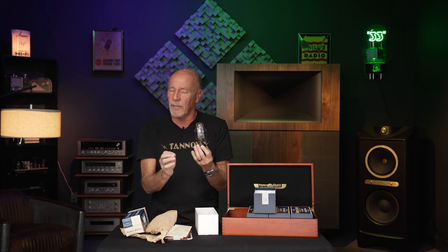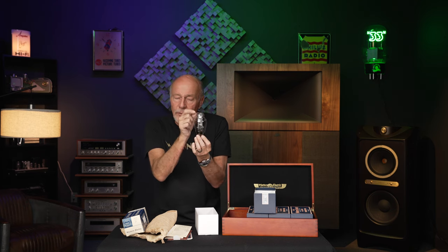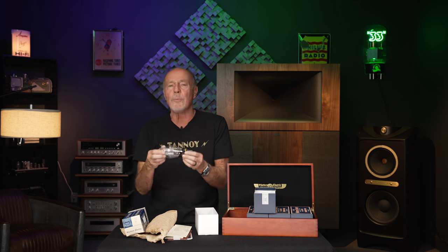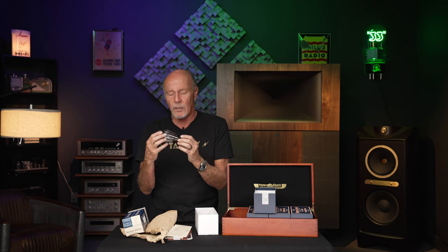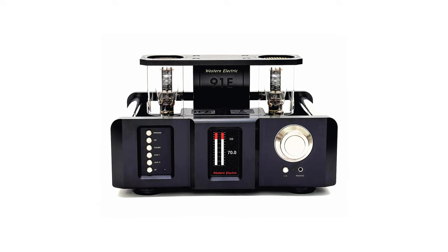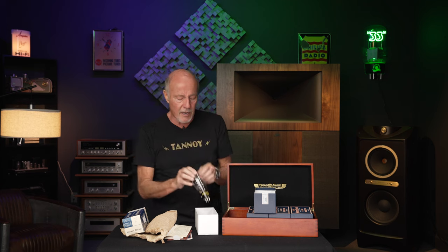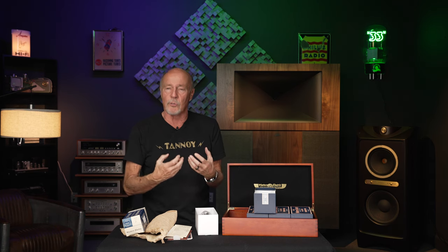Lastly, and most importantly, they improved the heater. This is a directly heated triode, so the thing that's glowing is the heater. In most tubes the heater warms up a cathode, but in a 300B the heater is the cathode — so the coating is absolutely critical. The result is a tube that's quieter, with a blacker background, a shimmer to beat the band, and a tube that is incredibly musical. In the 91E or any other 300B amplifier, you'll get improved sound and a tube that lasts longer.